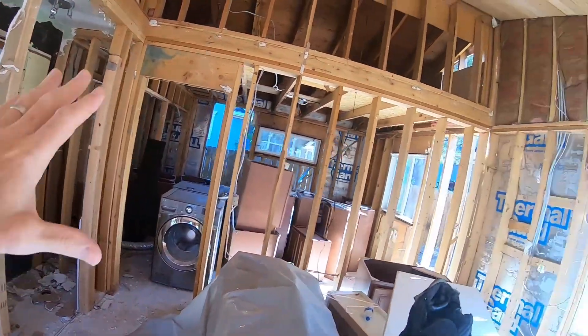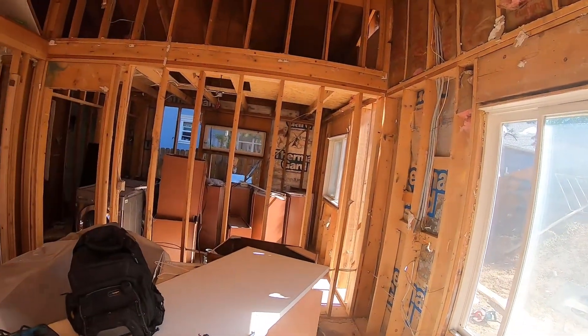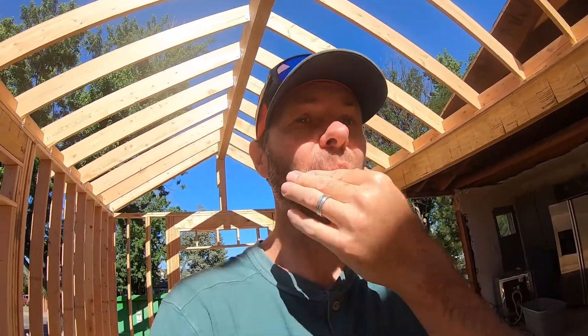We've got cabinets in here — all of this is the existing home, and this was the addition done in the early 90s. We ended up ripping all the sheetrock out so we can upgrade our thermal and energy efficiency values. We can go back in with a combination of more batt and some closed-cell spray foam as well. We're getting closer on finishing demo in these rooms — you stagger things because you need space to work and store stuff. The main priority is finishing our roof tie-in and starting to sheathe, using the ZIP system product for roof and walls. It's got a built-in WRB, and once it goes up we run ZIP tape on all our seams and fill nail holes — we're actually watertight at that point.